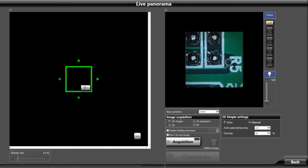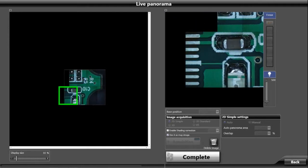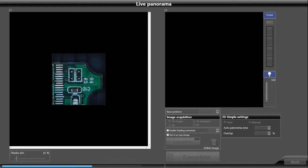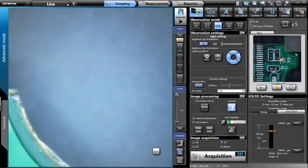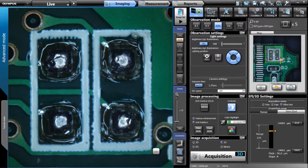Now there's also an auto function that lets you select a panorama area from 3x3 up to 21x21. When you select this and start acquisition, the software automatically moves in what they've nicknamed the tornado function — moving around in a cylindrical pattern. In the past you would manually drag or click arrows to drive to points; now the software drives around and captures a large area for you based on the array you picked, and that image gets placed in the map screen in the top right.